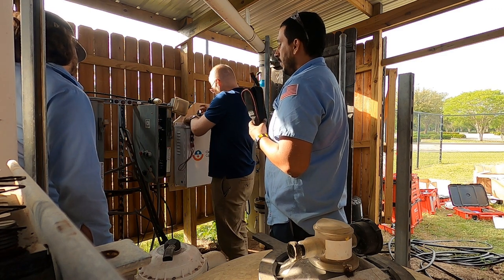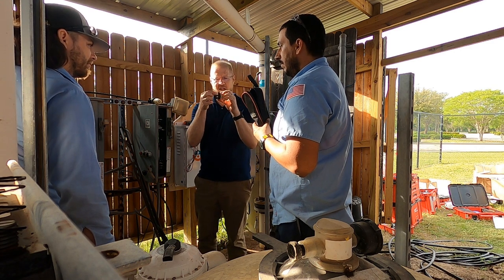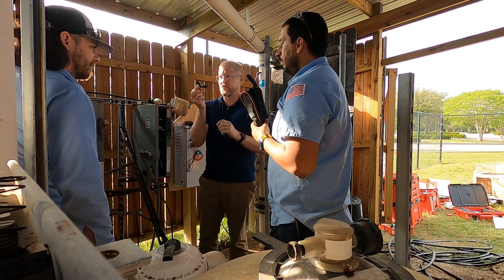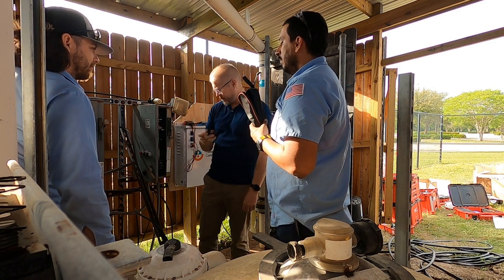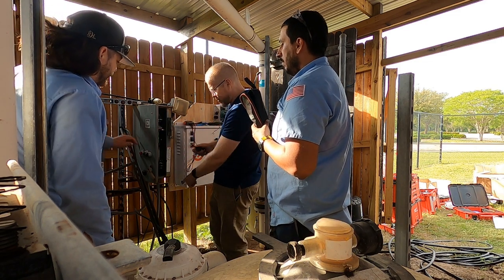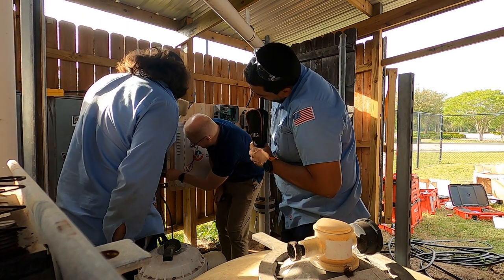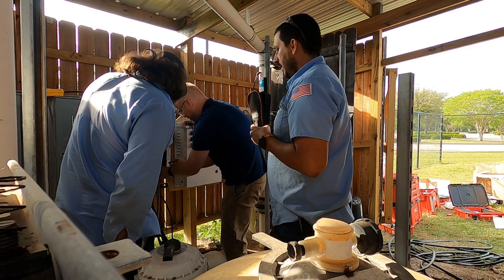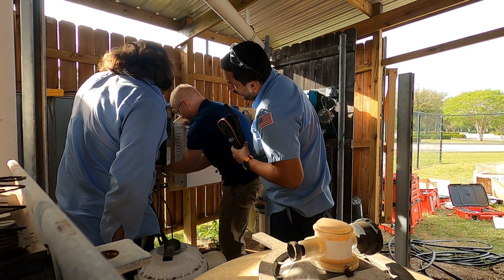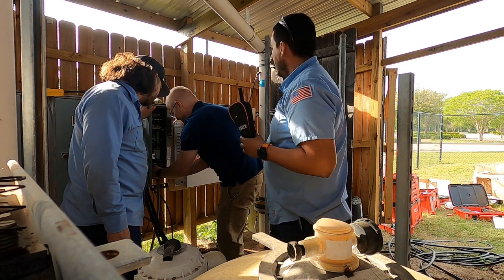So, this is the little Dwyer switch, and this is the split core, like I was talking about. This thing literally just pops open. You don't have to have a license to install these because we're only doing low voltage. We're going to clip this over one of the hot wires going out. So we already identified this is the conduit going to the pool pump, right? Yeah. And these are the three wires. They got them marked brown, orange, and yellow. Okay, and so I'm just going to grab yellow and literally just slip this over it.